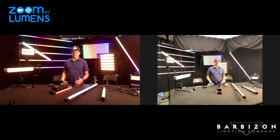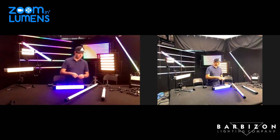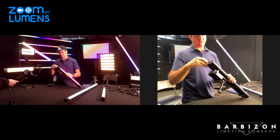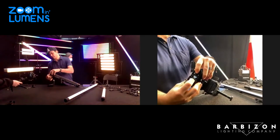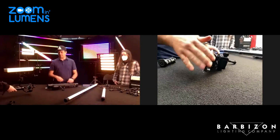No worries. So the other thing with the software is that as it's evolving, we're constantly releasing new versions of the firmware. For anybody that has a lamp, I always say before each shoot, just go to the website or subscribe to the update list for the firmware, and we'll let you know when new stuff is released. To update the lamp, it's a little USB-C drive, and it's super simple. You just plug it in here like this, power the lamp off, hold the enter button, power the lamp on, and that's it. Now this lamp will update to the latest firmware that's on this USB drive.